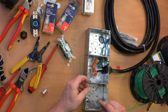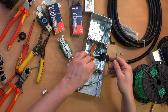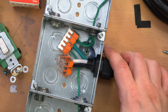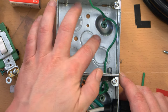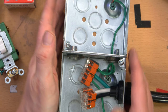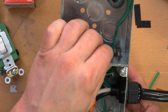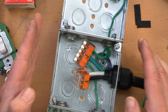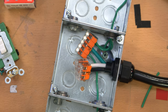Maybe I should have left this a bit longer, but on the other one I'll add some more slack to it. Always better too long than too short, I guess. And now all three boxes are bonded to ground via this Wago connector to each of these grounding terminals or bonding screws. That's probably overkill because these boxes do have a pretty decent electrical connection to each other — these are clamped down pretty tight and biting into the metal. But overkill on grounding is always better than underkill, in my opinion.